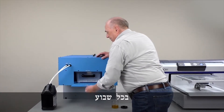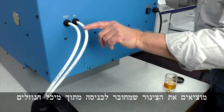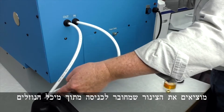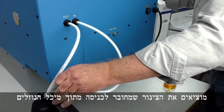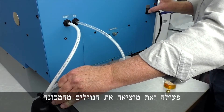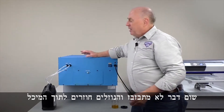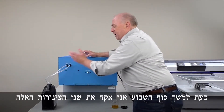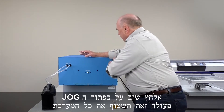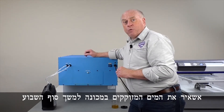Every week, I'll want to flush the system out. I'll reach to the end hose and remove that from the container, then press the jog button. That's flushed all the pre-treat out of the machine — nothing's wasted, all back into the container. Then over the weekends, I'll take both hoses and put them in a container of distilled water and Simple Green. I'll press the jog button again — it will flush through the entire system. I'll leave that solution in the machine over the weekend.